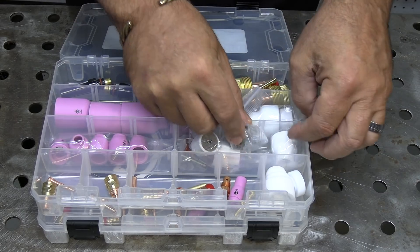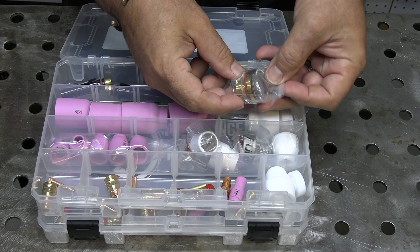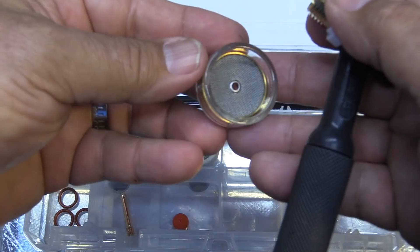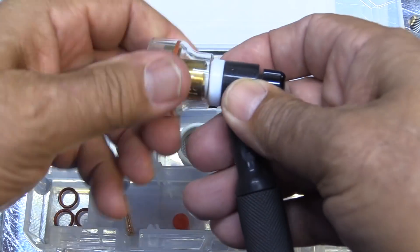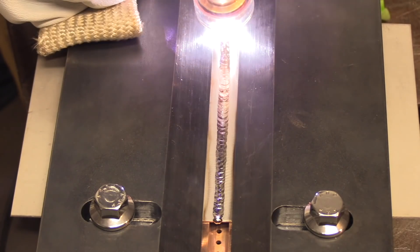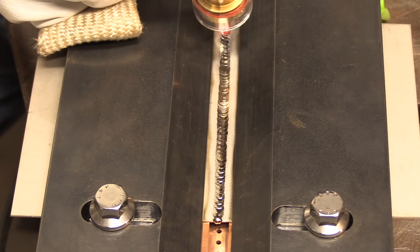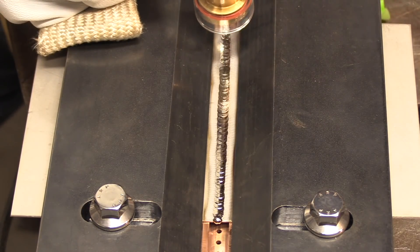The clear version of the number 12 cup is also included, with a titanium shield on it — you can use it with or without the shield. It's great for everyday fillet welds with a long stick out where you can see everything going on, with that big argon-shielded area all around the weld. A fillet weld will help trap argon, but on an edge weld, the edge wants to split the argon shield, so having a big blanket of argon really helps. On edge welds, I find it really helps to use pulse — I'm using 50 pulses a second, 33% background, 33% on time, at 25 CFH. For certain alloys, mainly titanium, you need an even larger shield — the BBW with a new design works great for titanium, with no discoloration on a titanium test joint just like you'd take for an aerospace job.